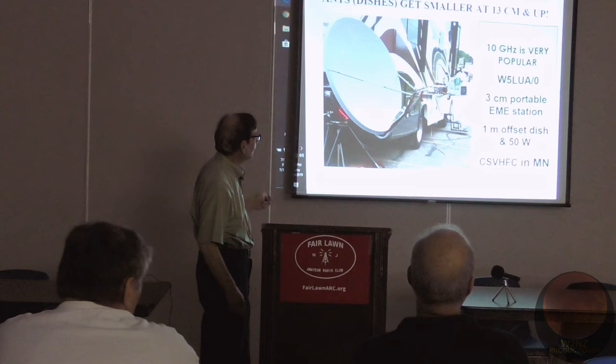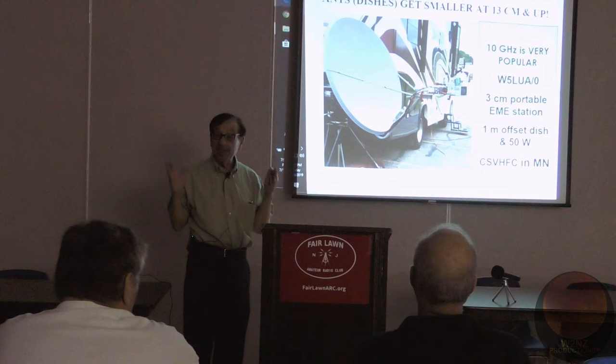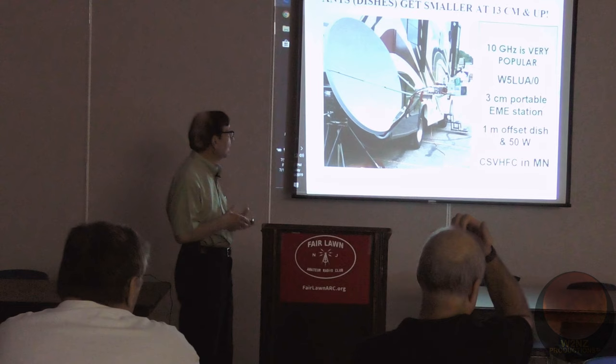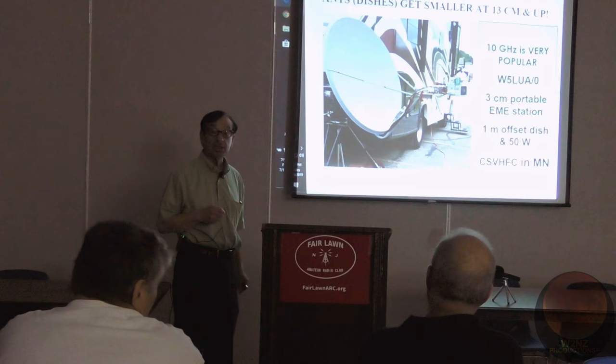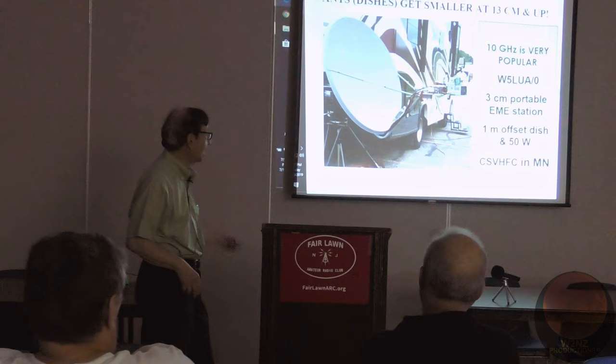This is a 1 meter dish, portable setup at three centimeters, 10 gigahertz, that's 10,368 megahertz. And it was in operation. This was a demonstration at one of the VHF meetings done by W5LUA. And it just shows you what you can get by with. You can hear your own echoes with this type of setup and work a majority of the stations that are active with a 1 meter dish.